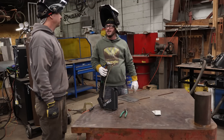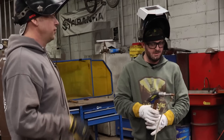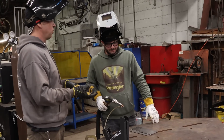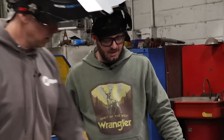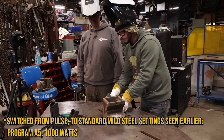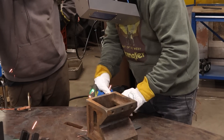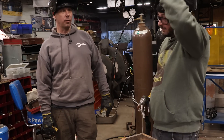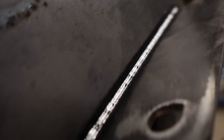It's just the torch angle — not a big deal. Yeah, there's a lot to remember the first time. It wants to be parallel to the plate, at the apex 45-degree angle. Don't push down on the torch too hard because it's going to affect the wire coming out. Once it's set properly you're just holding the triggers and letting it do the rest of the work. That's the type of weld you'd get on 11-gauge carbon without any special settings, which is not a horrible weld at all.